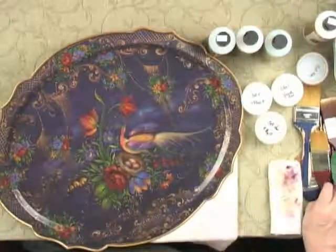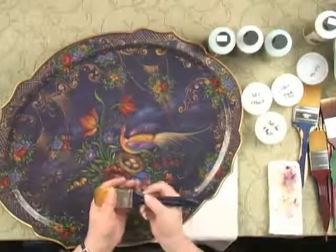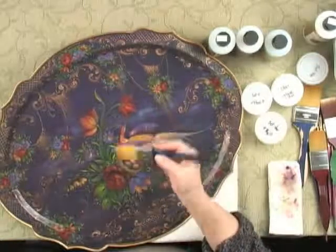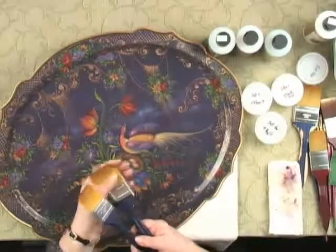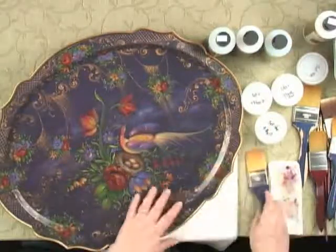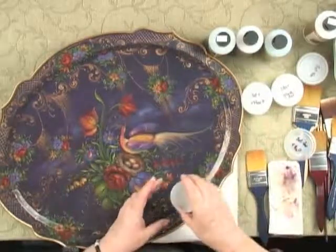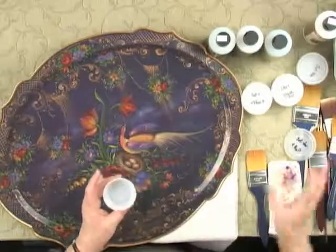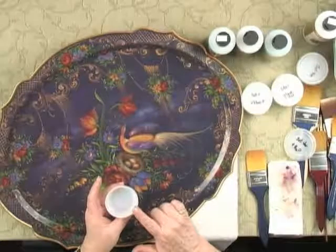The second hint is to take as large a varnish brush as you can afford — this is an inch and a half. I actually have a two inch brush but they were terribly expensive and we discontinued them. Then take your varnish — I use satin on this tray — and add a good bit of water to it. I have almost one part water, one part varnish.